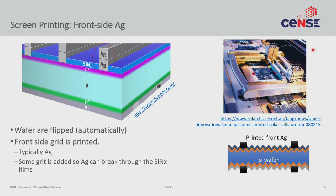This is what an inline screen printer looks like. You can see that wafers are coming in from one direction and going out the other. Within seconds, these patterns are being printed. You can actually see the front electrode patterns on the wafers here, and no pattern on the incoming wafers yet, as the process continuously keeps happening.